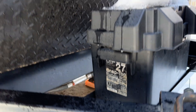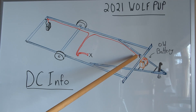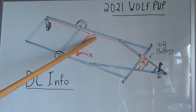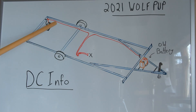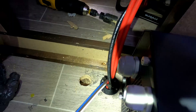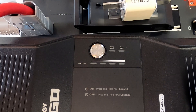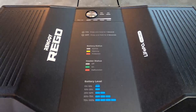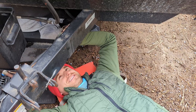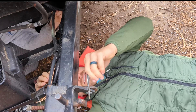The DC system is wired with the old battery on the trailer tongue. The positive and negative battery wires connect to a positive bus bar and common ground underneath the trailer at the forward floor beam. The positive DC cable runs halfway back along the driver side trailer frame until it meets up with the DC wire connected to the control panel at the rear. Both wires then cross to the passenger side along the underbelly and come up into the kitchen cabinet to connect to a battery disconnect switch. Since the new battery has an easy-to-reach on/off button, we no longer need this disconnect switch. To disconnect the old battery, we simply removed the battery cables from the terminals, then disconnected the old cables from the positive bus bar and common ground, being certain to leave all the other wires and grounds installed as we found them.